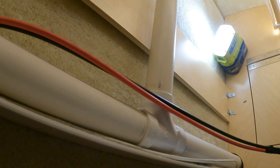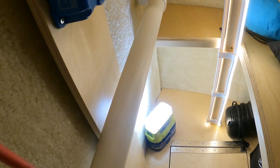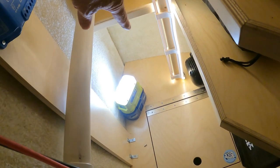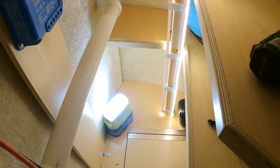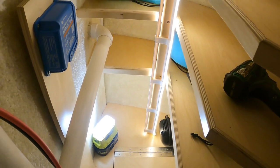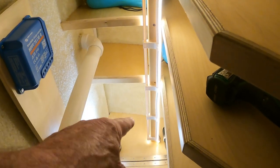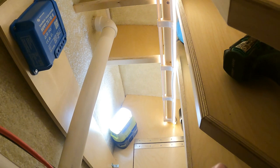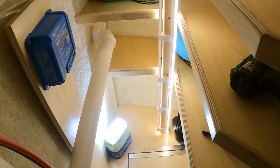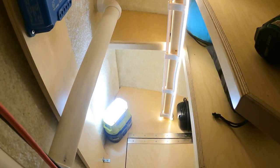This is the wires from the panel. And before I do that, I have to get my power wires from the trailer. So all we're going to do is run power wires down and connect up into the same places where the light kit connects to the trailer. So it's going to be wired to the trailer wires, just like the light kit is. There is already a 10 gauge wire that goes from here all the way around to your battery. So we don't have to run any wire over to the battery at all, because it's already there. And we used those 10 gauge wires when we put in this light. So we're going to do the exact same thing. Going to connect it to that.